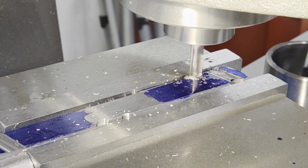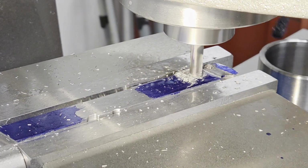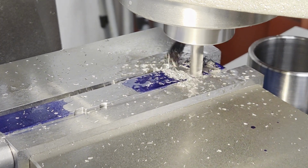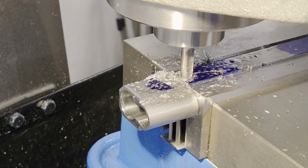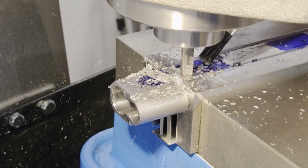I installed the 5/16 end mill, traveled to the location of the next forward serration of the rear serration group, touched off to zero my Z-axis because I installed a new bit, then made that 20 thou deep cut in one pass. I moved to the forward 5/16 cut location and cut that 30 thou deep serration. This process was repeated for the 1/4 and 3/16 end mills.